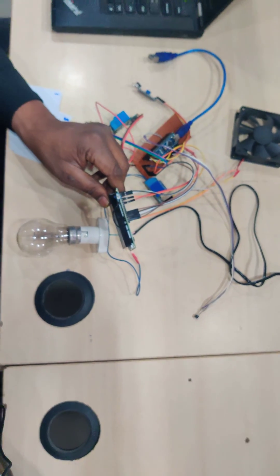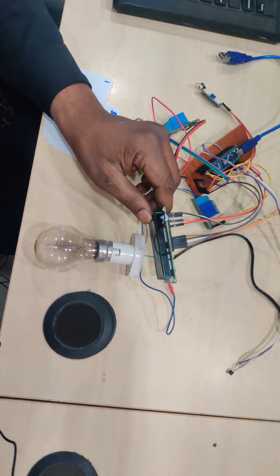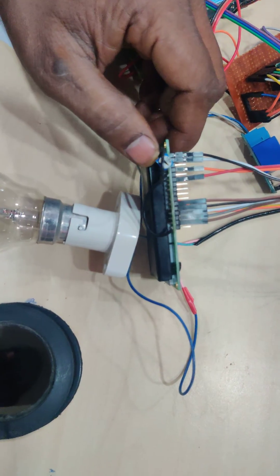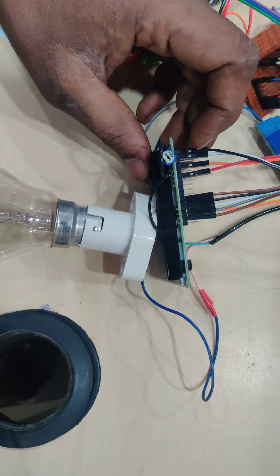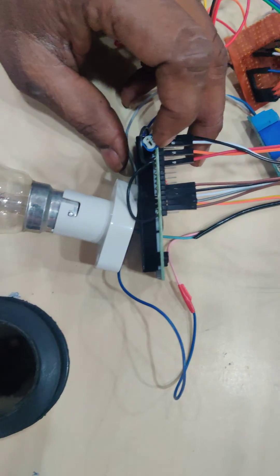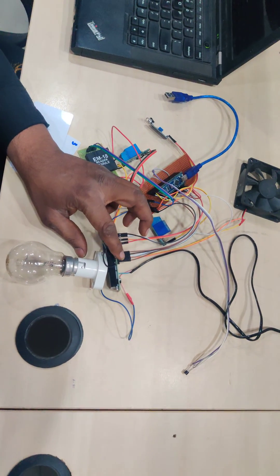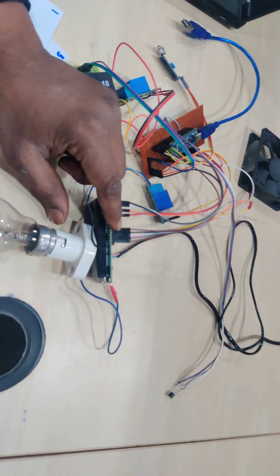The first and second pins are power supply pins, the third pin is for contrast adjustment using a variable resistor. Pins 4, 5, and 6 are the three control pins: RS, RW, and Enable. Since mostly you do write operations, RW is connected to ground permanently, and you handle only RS and Enable. The four data lines used are D4, D5, D6, and D7 — the MSB part — plus the last two pins for backlight support.